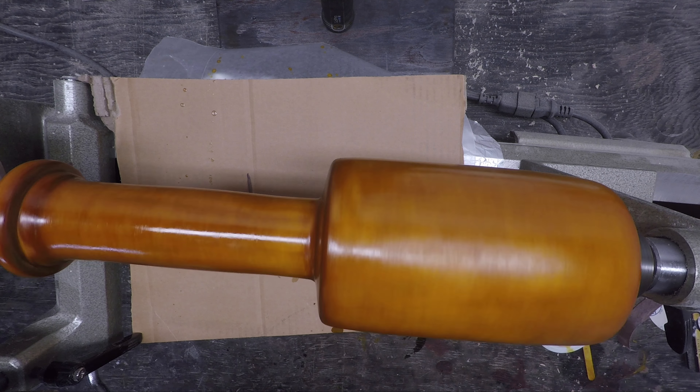I don't think the fingers had as much of an impact as the high humidity did. But again, it's a hammer, so I wasn't quite as concerned with the final finished product results, and I wasn't looking for an absolute glass finish. While I was running my lathe and applying that shellac, I ended up getting some fibers from the cotton cloth that ended up grabbing — because it was so humid, the shellac started really grabbing onto that cotton cloth. So I always keep a tweezers nearby for when I'm doing my sealing process, so that if something does happen, I can try to pull it out before the sealer starts to set.